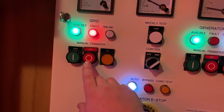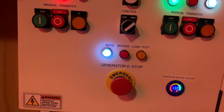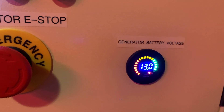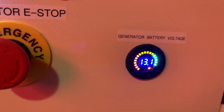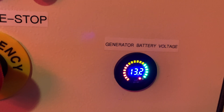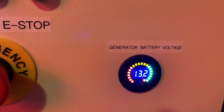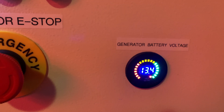Okay, now let's turn off the grid. That's pretty good. You can see our battery's down to 13. But now that the generator's started, it's rapidly going to go up until it goes into some sort of overload. I don't know why the generator charges the battery so much — I wouldn't say that it's good for it. It gets up to about 14.6, nearly 15 volts, so it's quite high.